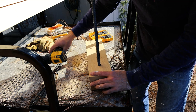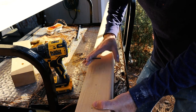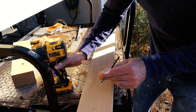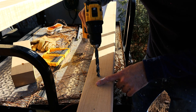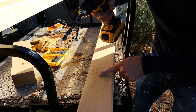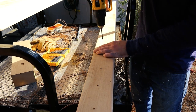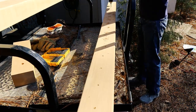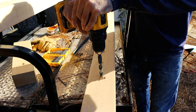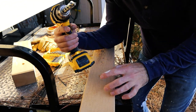That's nice and snug right there, so I'm going with a half-inch drill bit. One more step — I'm going to take a medium-sized drill bit, three-sixteenths, and get little starter holes going so that way the drill tip doesn't bounce or slide around, even though I've already nail-punched these. There's a huge difference from the half-inch drill bit to the little holes I nail-punched. I'm going to try to make these as straight as I can.